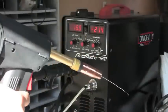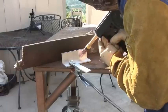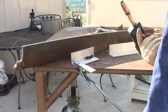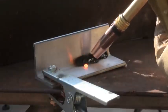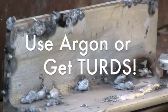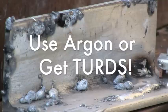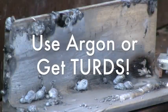I'm fixing to show you all me welding, and I'm trying to figure this thing out for a long time here, getting frustrated for too long. The nozzle was getting stuck as I was welding, and I finally figured out the problem after trying all kinds of different settings and making a bunch of turds like this — that you have to open the cylinder of argon gas. Otherwise it won't work. I had it all hooked up, I just forgot to open the gas because I went inside to get coffee, and I always have a habit of turning it off.